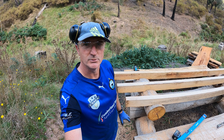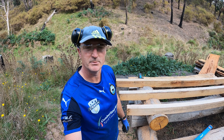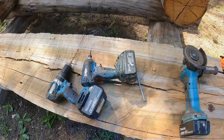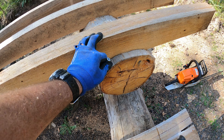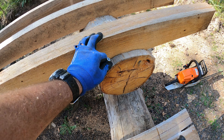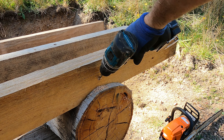Okay, with all those three pieces set, I'll just get some screws and screw those in place and then we'll go about loosely putting on the tabletop. I'm going to say loosely - I'm going to kind of position it. There'll be a lot of overlaps because it's all live edge. So I'll loosely position it and then I'll come in and trim some of the edges that butt up against each other, so we get a bit of a continuous tabletop with a live edge on the ends. This wood is a purchased hardwood and it is very dense, so I do need to put a starter hole in there. I've managed to find just a small diameter drill so I'll use that to create a starter hole. Once this screws in it'll screw into the logs pretty easily.